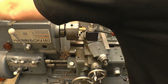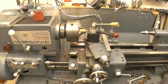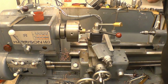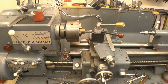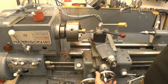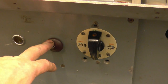All ready to go, everything set up. Start the lathe up, engage the feed nut. Cutting the thread. Once the tool comes clear, disengage the clutch. Cross slide — take that in so the tool is disengaged from the thread. Stop the lathe.